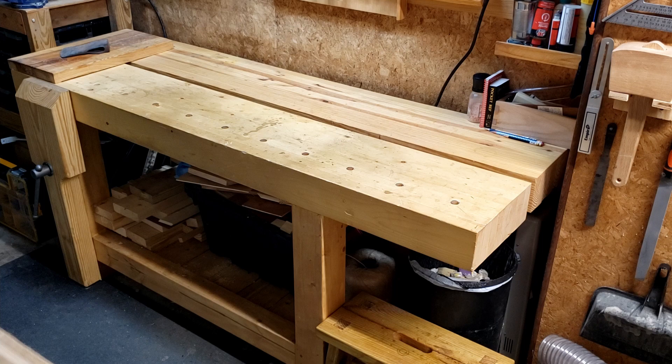I made the front slab out of white pine as an experiment. One of the most frequent questions I am asked is: do the boards try to delaminate? The answer is no. Even with my shop's drastic seasonal humidity changes, I haven't had any gaps open up. As I mentioned earlier, the prep and clamping is a critical aspect of joint reliability. The boards must be completely flat and have a clean face for the glue to really bond, and the high clamp pressure ensures that the glue pushes deep into the fibers. I rolled a liberal amount of glue onto both sides of each mating surface. The squeeze out was incredible, but well worth the effort it took to clean up.